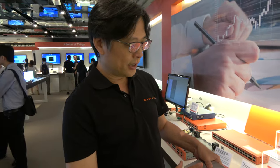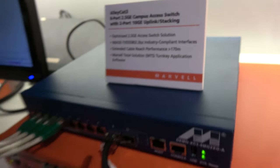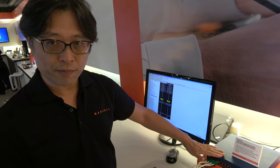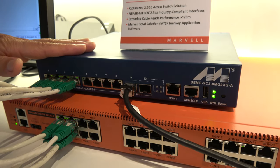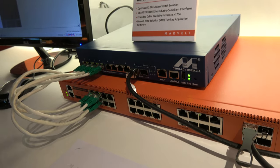So in there do you have dual core Cortex-A9? This box is for home users, so it doesn't have a processor embedded. This is the LeCat 3 — that's our SMB switching product. This box provides 8 ports at 2.5G access, plus 2 ports at 10G. Marvell believes the SMB market is going to upgrade from the current 1G to 2.5G. So it's 2.5 times faster for each port.